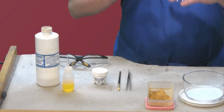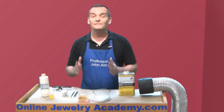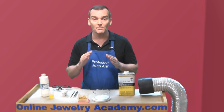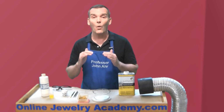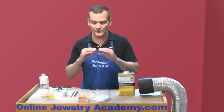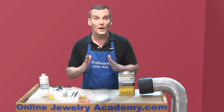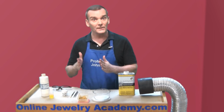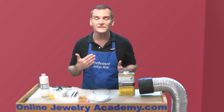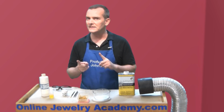All right, so let's start from the beginning. What does flux do? Well, flux, no matter what type you use, helps to keep the surface of your metal object clean while solder flows into the seams and helps to unify and unite those pieces together so that they become one whole. Now, it doesn't matter if it's liquid flux or paste flux or homemade flux, they all basically work the same. But there are some pros and cons to each one.